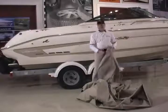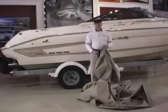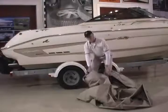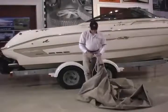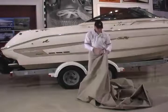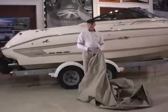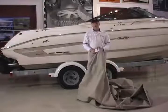The bow, on the inside, has all the reinforcement patches. There's a sewn-in label that indicates this is the front of the boat. On a V-hull bowrider, it's easy because the bow is very pointed compared to the stern, but you want to locate that bow section. You also want to find the stern — there's a cutout where the rope comes out, and another sewn-in label. That label has the manufacturer, part number, a description of the boat, and the date of manufacture. It's always a good idea to cross-reference the part number on the label with the part number on the box you received, just to be sure the two match.